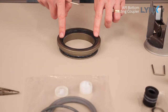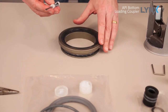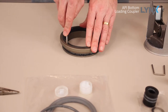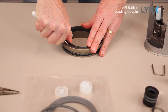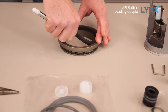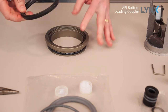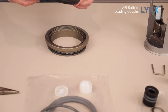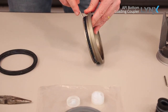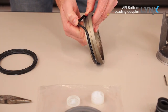To remove your product or nose seal and your adapter O-ring, you want to take your flathead screwdriver and carefully work it in the outer edge. You want to be really careful to not damage the adapter ring. You can just gently pry that seal right out of the groove. There's your old seal. Now we'll do the same for the outer O-ring, being careful not to damage the adapter ring.